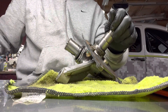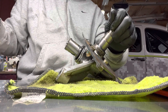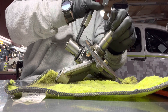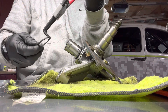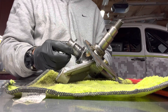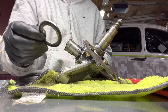The first thing you want to do to get this apart is take out the top snap ring. Get yourself a good set of snap ring pliers — don't get the lightweight ones because they'll tend to break. Go in there and take that right off the top. As it comes out, the first thing on there is their washer, which you're not going to reuse — you can hold onto it just in case you need a washer that size for something else.